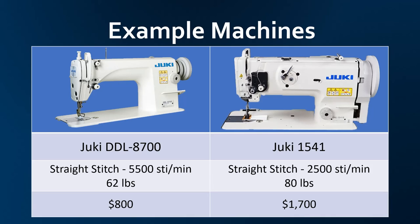One of the things that people get into is they buy these machines, and the very next thing they want to do is slow them down. Unlike the residential machines like that Brother, which has a nice digital slide to slow the machine down so the foot pedal isn't quite so racy, these machines don't have that. And the ones that do — even the minimum speed is still really fast. Because of this, a lot of people end up buying pulleys. The pulleys basically act as a reduction drive on the belt. They're not the easiest things to install — there's going to be some screwing and bolting involved. You might think you'd be more productive with this really fast machine. Just understand, maybe that's true — but the next thing you might be doing is spending more money to try to slow down the machine you bought because it goes too fast.